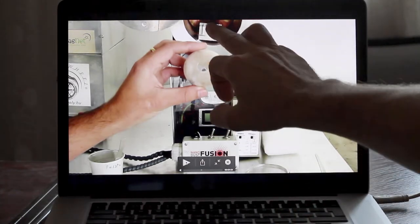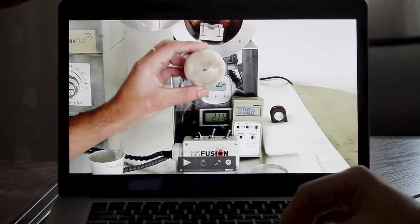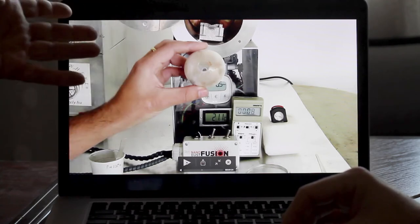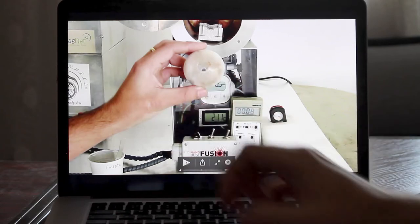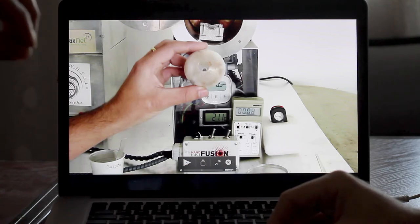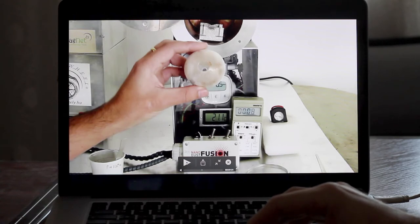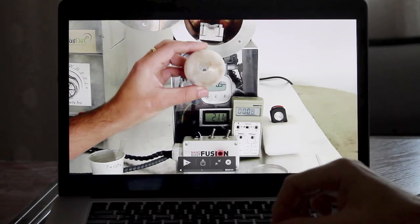And the height here is important in terms of... Important. If you don't put this acoustic resonator at the highest intensity of the electric field, then the system won't ignite. Simply. And are you focusing the intensity on the carbon rod or on the carbon dust? Both. Actually, the maximum intensity field region is about 2, 3, 4 centimeters wide, and the rod and the carbon dust must be in the maximum intensity place. It takes patience and weeks to figure it out for each design. So it's not a simple step. And once you have that, though, it's very repeatable. It's absolutely repeatable.